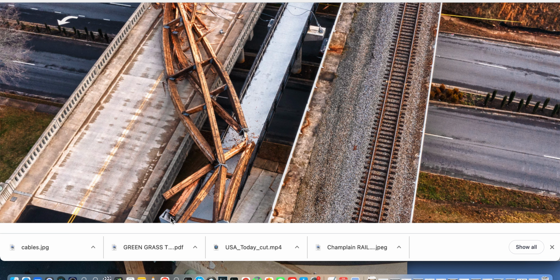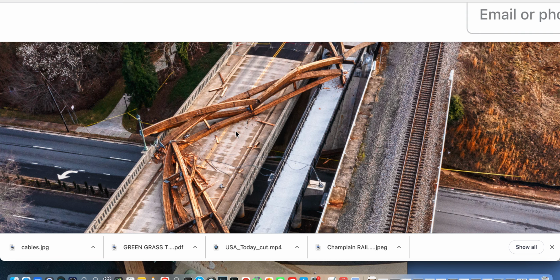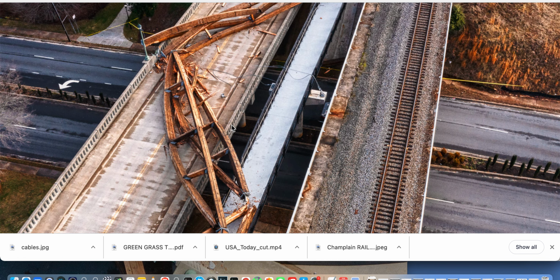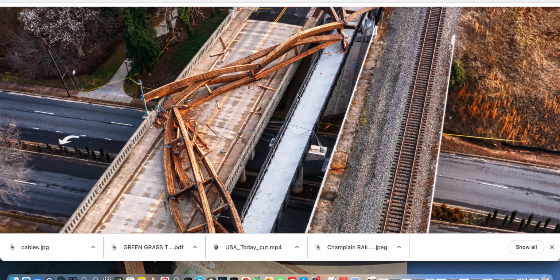where you don't need to have so much of an overturning action, like a post that you put in the ground to hold it. A base cap, these caps are just very, very, in my words, insignificant, because they don't have the ability to stop the overturning. The overturning is never supposed to happen because it's supposed to be always in compression, I believe.